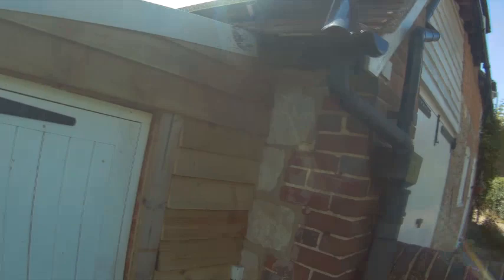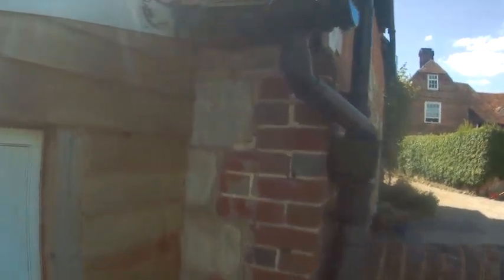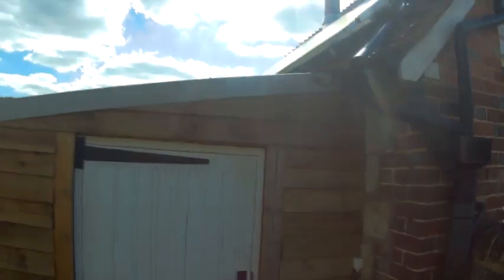So the coping there, the fascia, I ended up taking off, moving back, putting a batten across the top of the roof, just to take up the extra space, which has all occurred because of where I brought it out, and that just finishes this end off. I could do that purely because this end overhangs, I think they call that the gable or whatever it is. I just need to shorten this pipe, that's why I haven't put that back up there yet. But where this overhangs, there's enough there that I could actually do that.